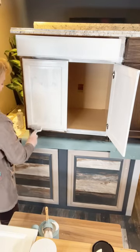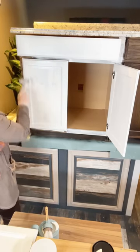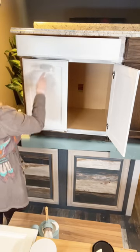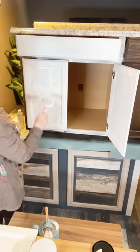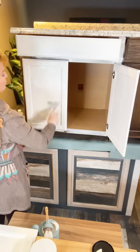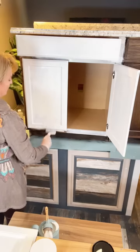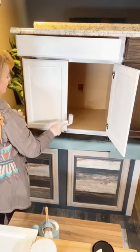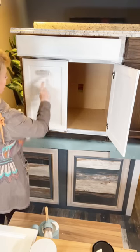Here's a grand example — there's not enough paint here. I've talked too long and it's already started to dry. I'm not going to get this to solid cover here, but remember this is my first coat, so I'm not going to panic. Just roll any direction, lightly roll, let it dry — call this the ugly coat. I'll come back and get more coverage on the second coat.